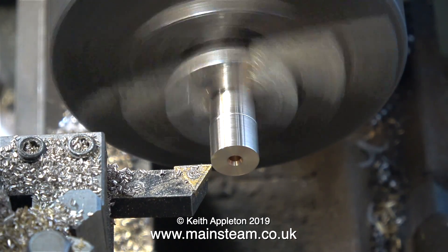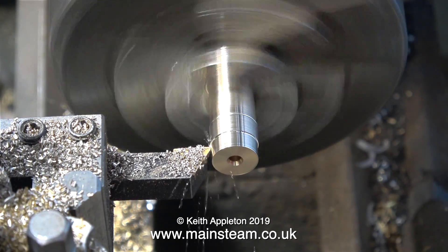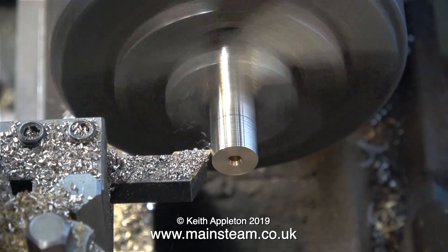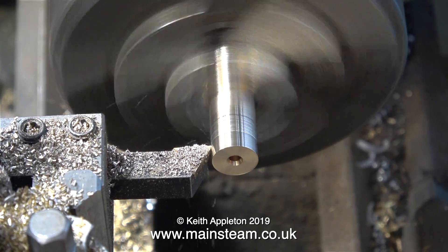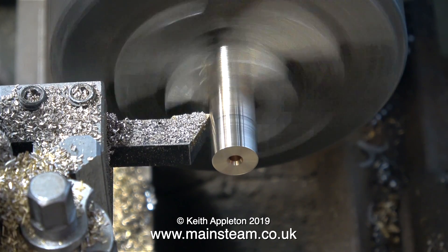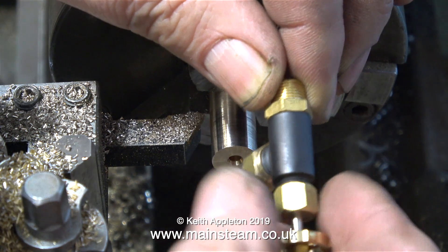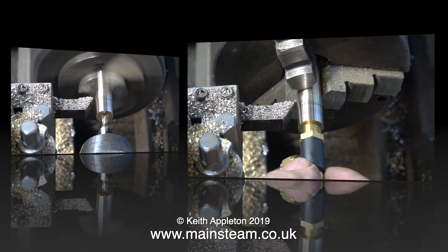Plus, it gives me the opportunity to show beginners turning operations in a lathe. After turning one end of the piece of phosphor bronze, I put it in the chuck the other way round and turned off the larger diameter from the other end. This is not good practice at all, because it's not going to be 100% true. But trying to keep it real — this is only a water pipe fitting, not a part from a steam turbine, a rocket, or a satellite.